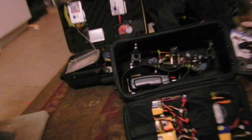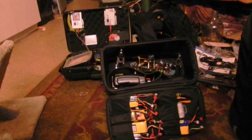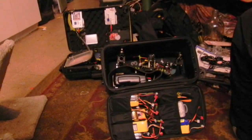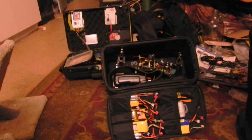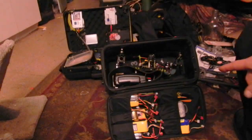This is the new 5.8 ground station. We're going to get the 32-channel, 2-channel system which uses two separate VTXs. It can be used with this new VRX — the 32-channel 5.8 — so you can have inputs from two different channels and outputs from those two channels, or you can have diversity from two different antennas. That's the new one that's on eBay, so we'll be testing that out.